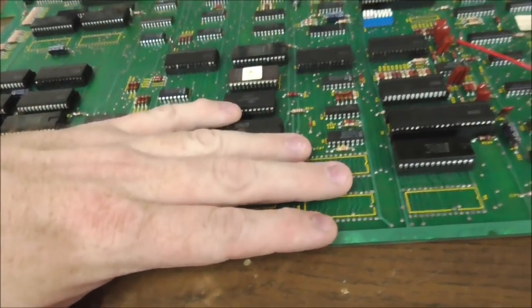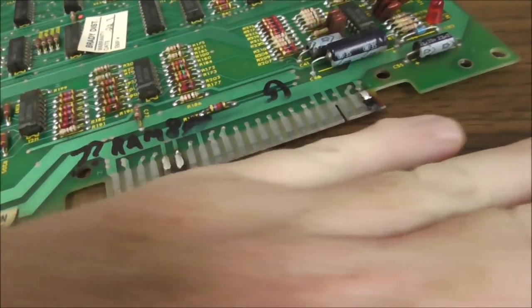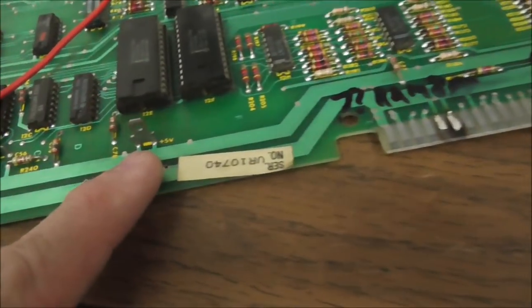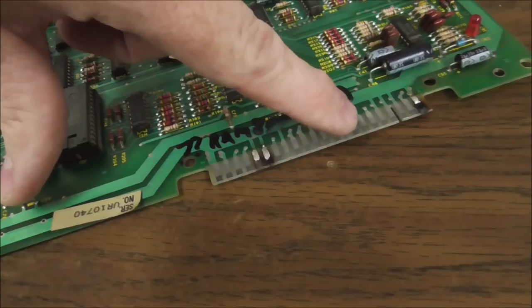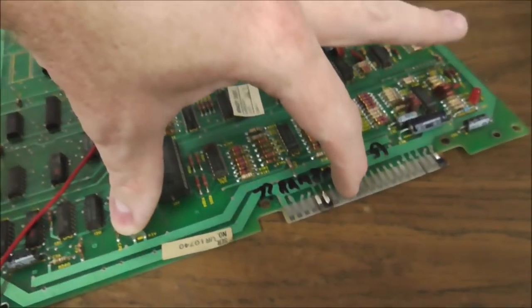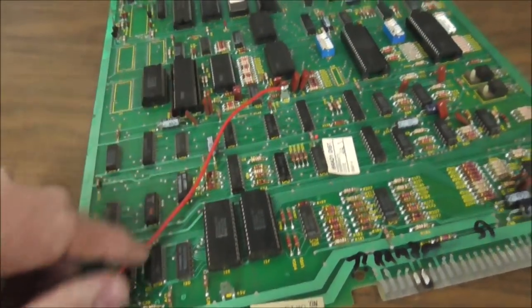So we've got battery damage to take care of. We've got to clean all these chips. We might have to add some more jumpers. We have to fix the edge connector. And a lot of times another thing people will do is put extra wires on the harness so that you can jumper the five volt to this five volt spade — now you've got two connections. So we'll probably do that too: maybe an extra connector for the five and an extra connector for the ground. I'm going to look online and see what people suggest about these jumpers.